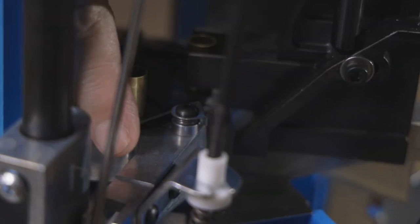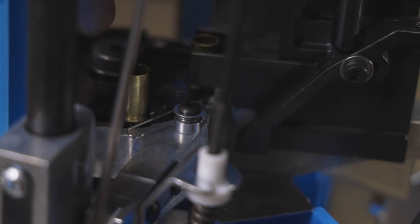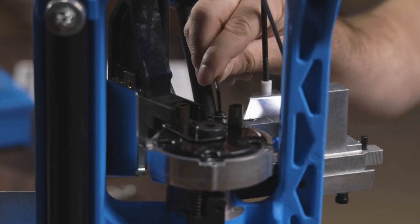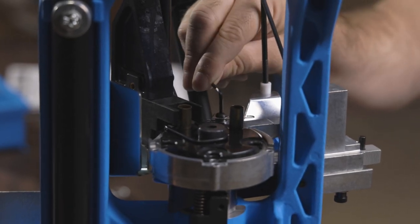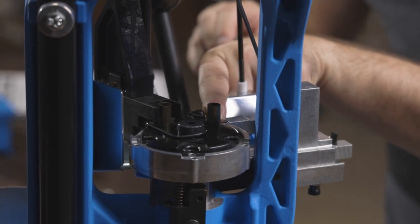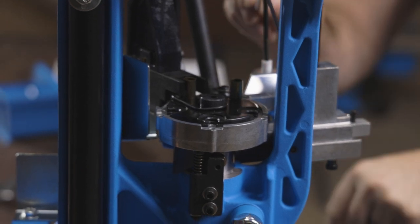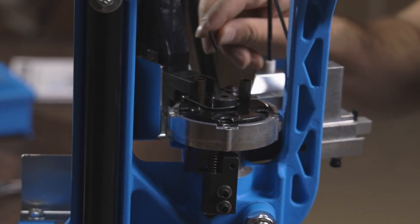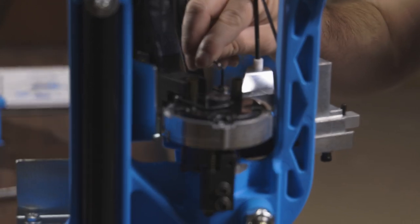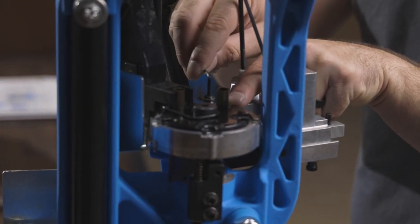Yeah, so this is the part you'll adjust. Put that Allen wrench into that screw. Okay. Put that in there, loosen that slightly. Okay. Now with your finger, push that spring up till it just touches. Just barely. It's not there to push it in, it's there to keep it from coming out. So got it, just barely touching it. Just kiss it and then tighten it back up. Oh, so kind of hold it in place with your finger. Yep. And then tighten it. Got it, correct.